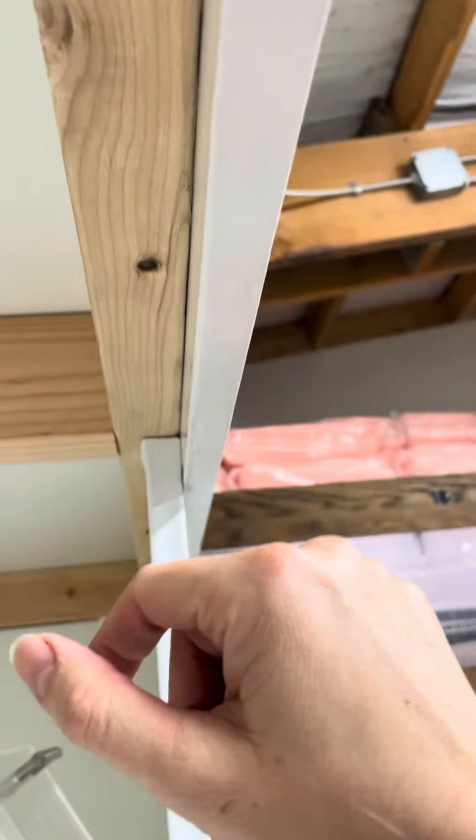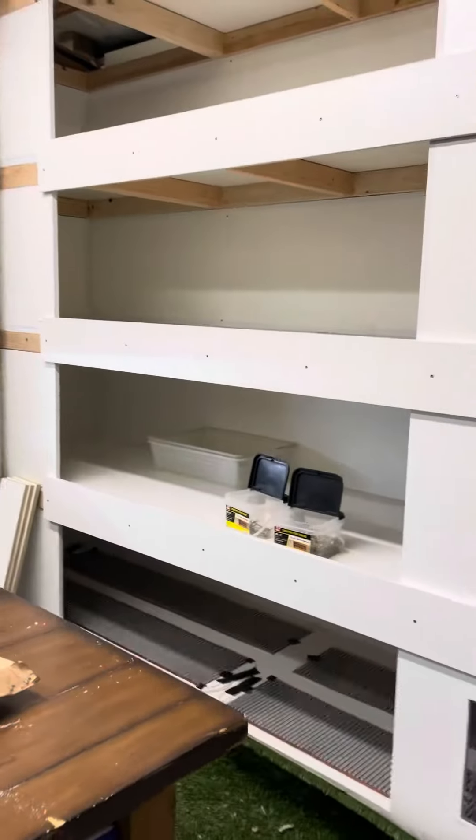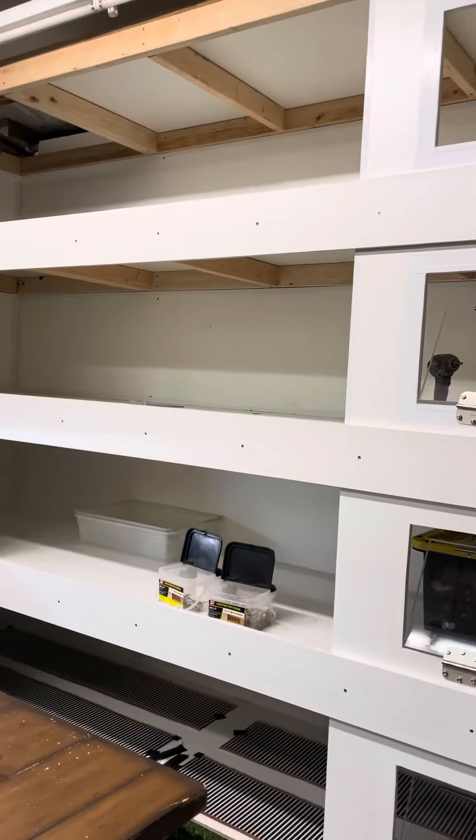When we do the eight-footers, we don't use a two-by-four frame — we just have the melamine in between, and the front piece screws into the edge of the melamine. That's what locks the whole front together. It's a really good way to make a single structure all locked together — really efficient.